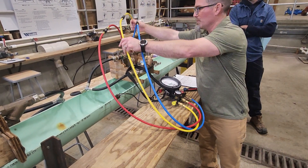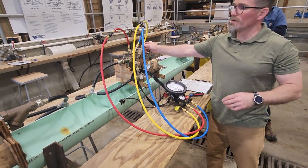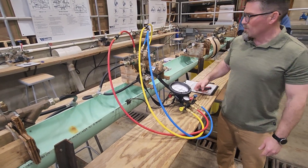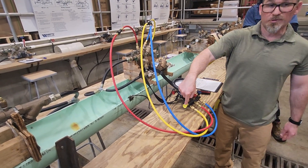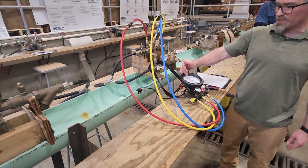Flush it out and then put the bypass hose on test cock number 4. That doesn't need to be a wet connection, just needs to be flushed. Just flush it out, get the air out, close it up, put it on. Once you put it on, open test cock 4. Now we've got to reestablish that zone — bring it back to where it was at the beginning.